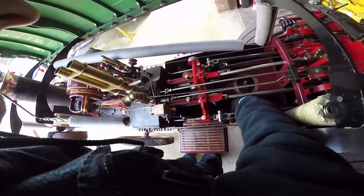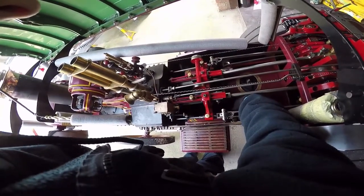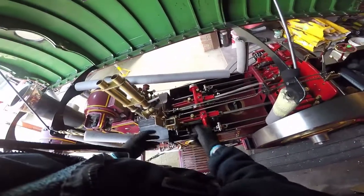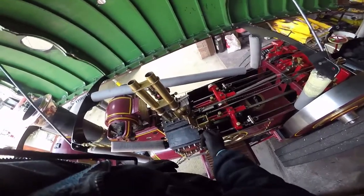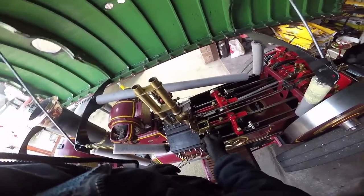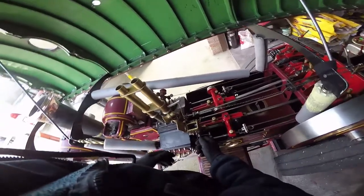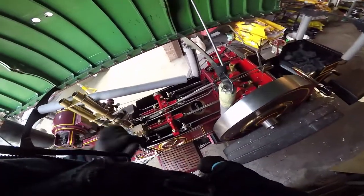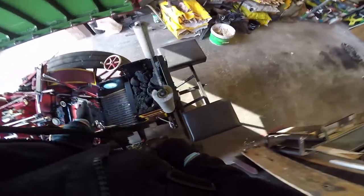The mechanical water pump valve is open because the line is in line with the pipework, so it hasn't been changed. The mechanical lubricator still has some oil — counting the drops, we get to 20, and the level has gone down so that is pumping. I have a couple of torches for the man stand so you can see the gauge glass.